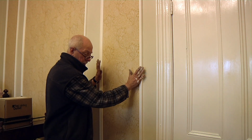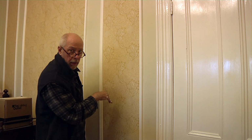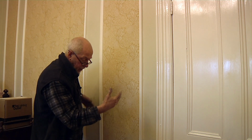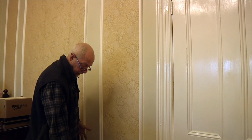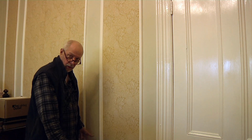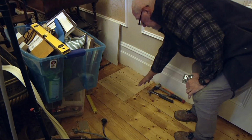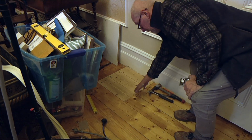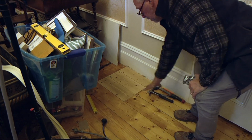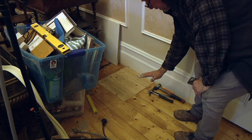We've had a plasterer who specialised in doing these sorts of things install all these. We've wallpapered and painted, etc. So this is where it originally sat. I've had to fill in the hole where the ducting came through, and I'll show you that in a second. As you can see, I've cut some Baltic pine floorboards and managed to fill the hole. I will give them a final sand before I paint them, and they'll be clear finished.